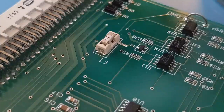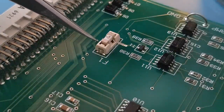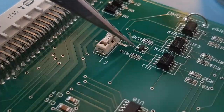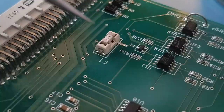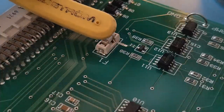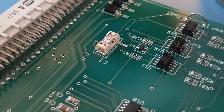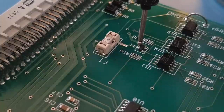Right, so the final part of the repair now is just to test it all out. I should be getting a signal from this wire around the back here, coming from this pad. It's going through the fuse, and that's going to that point in T1. So I should get a continuity buzz when I put the probe point on there and the other probe point there. So let's quickly push that fuse down into the holder and get this buzzed out. Right, the fuse is in the holder. Let's get the continuity underway. I'm hoping to hear a nice loud beep.